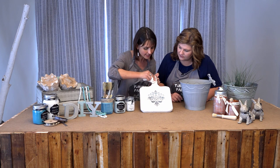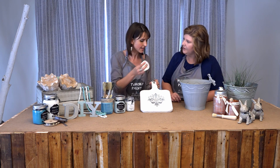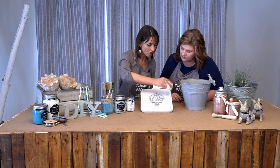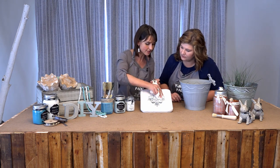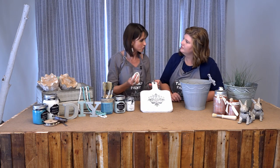Your paint does need to be dry for at least four hours before you start glazing. The paint doesn't take that long to dry, but there's a chemical process still happening, so the paint needs to grip properly on the surface before you start glazing.